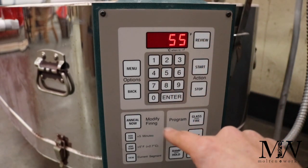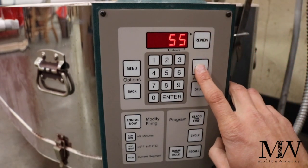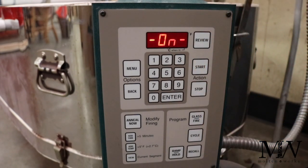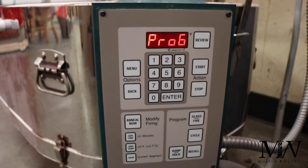After clicking alarm, it goes back through idle mode and all you have to do to start your kiln is press the start button. Now if you weren't sure if you programmed the right thing or you want to go back and check, you can always click the review button and run through your segments — it'll automatically tell you the different rates it's going through, which is pretty handy. You can hear that clicking, which means the kiln is actually on and running.